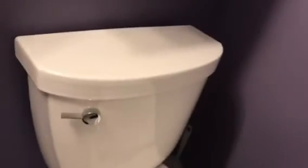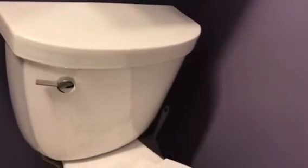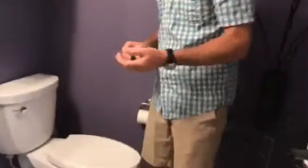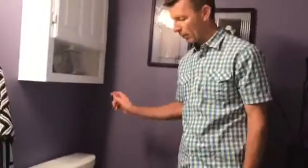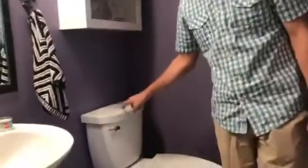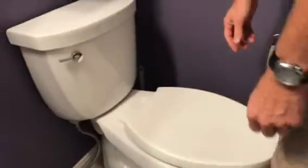All your green water is still in the tank back here and you've got no leaks. You're going to want to do this to each toilet that you have, just to make sure there are no leaks. Refrain from flushing overnight because flushing will ruin the test and you'll have to start all over. Do these for each of your toilets if you have any suspicion you might have a leak inside, because these can really use up a lot of water.